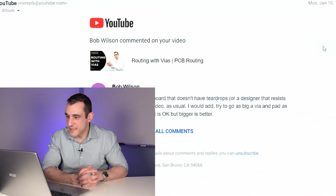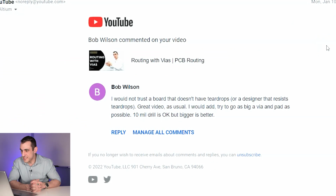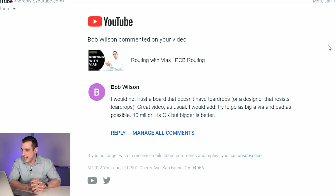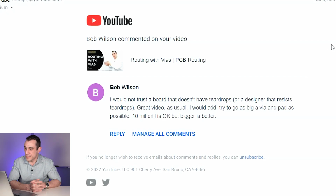Bob Wilson writes, "I would not trust a board that doesn't have teardrops, or a designer that resists teardrops. Great video as usual. I would add, try to go as big a via and pad as possible. 10 mil drill is okay, but bigger is better." Bob, you're right. Bigger is better. Bigger isn't always feasible, but you're right. Bigger is better when it comes to vias and the pads that are used on them.